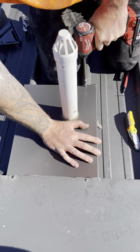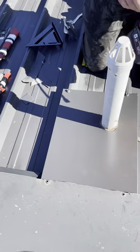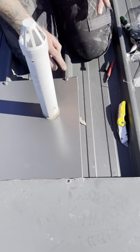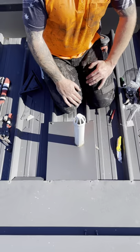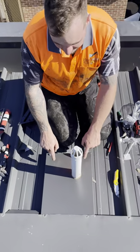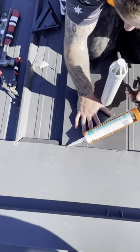Put a screw in to pin it down — there's one screw. Now if this was a longer flashing, I want screws up the flashing every 500mm. If it's a roof like this we hit every rib. If it's a corrugated roof you follow the roof pattern: miss two from the lap, hit the lap, miss two ribs, hit — I want that pattern followed. Every 500mm along the flashing if it's a 10-metre long flashing.